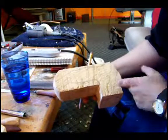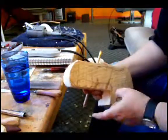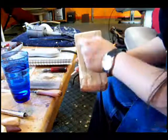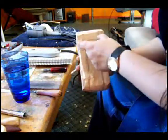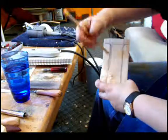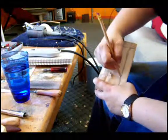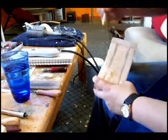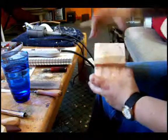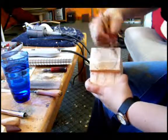Now we've got this little area where our relief carving is going to be blocked off. From here on in, basically we're going to be cutting off everything that isn't going to be part of the cane. If we look from the top, obviously we don't want our handle this thick. Go ahead and draw lines down to approximately the thickness that you want your handle to be. To be on the safe side, always leave it a bit larger or wider than it's going to be in the end — you can always take more off as you go along; you can't put it back once it's gone. Looking at our front, roughed out in a circle here where our relief carving is going to be, all this area here is going to be cut off as well.